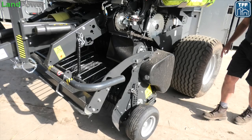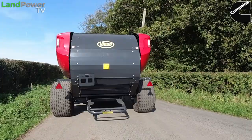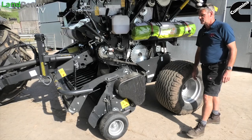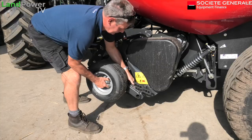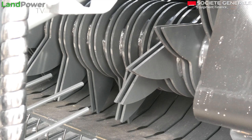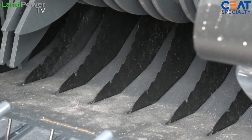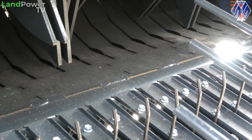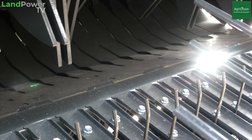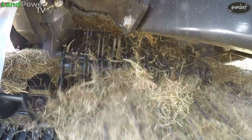The gauge wheel's on the side. The widest part of the machine is still the outside of the road wheel — this is on 500 tyres, and we do have options of tyres as well. These gauge wheels are pretty much almost in line with the road wheels, but we can actually take them off, and there's a convenient storage point if you needed to. We have a new rotor — we're 20% bigger than the 4325, we're now 520 millimetre, and we're now a 15-blade chopping system as opposed to 14. We've still got our famous parallel action drop floor, but we've altered the profile to give a smoother intake, and combined with a new rotor the intake is really impressive.